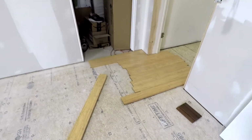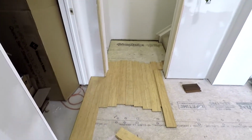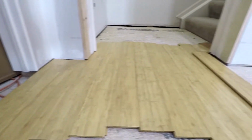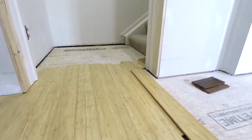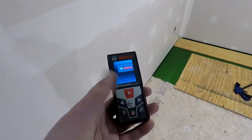I needed to decide which direction I would install the boards. Often boards are run parallel to the longest wall. However, my biggest deciding factor was the landing at the bottom of the stairs, and installing the flooring in this area was easiest in only one direction. I also preferred this orientation because it seemed to make a stronger flooring at the other two doorways.